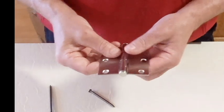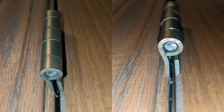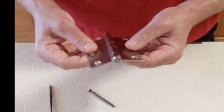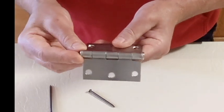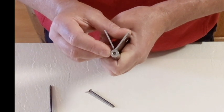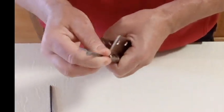When it comes to standard style hinges, there are really three types you're going to typically see. In the first style, if you look at the bottom of the hinge, it's wide open and you can actually see the base of the hinge pin — those are the easiest because you can take almost anything in there and start driving that hinge pin out. The second style is a miniature version of a commercial style hinge. The top of the hinge pin looks like there are two hinge pins — there's a disc affixed to one of the plates. When you reverse it over, there's a hole in the bottom of that plate. That hole is going to vary in diameter; sometimes it's big enough that you can get the masonry nail into that hole to start driving that pin out.